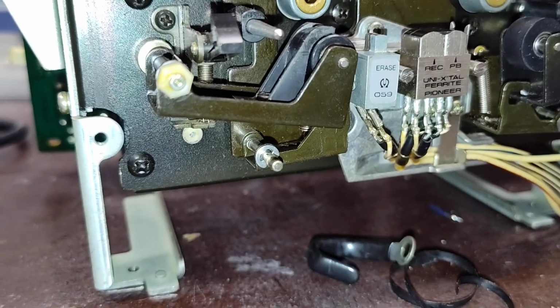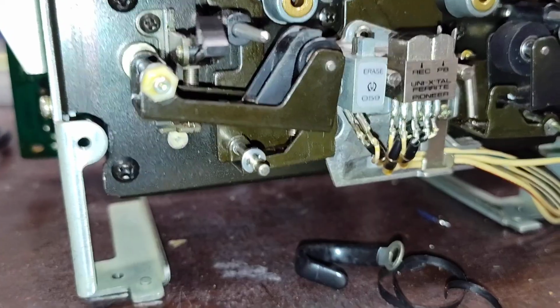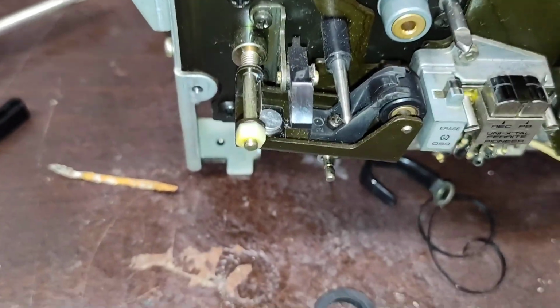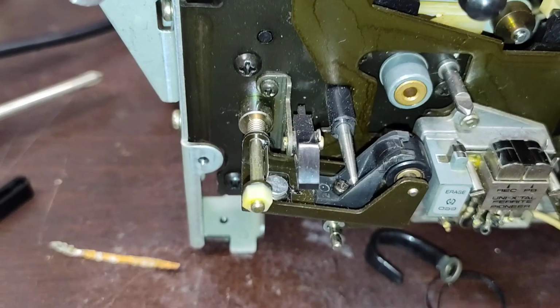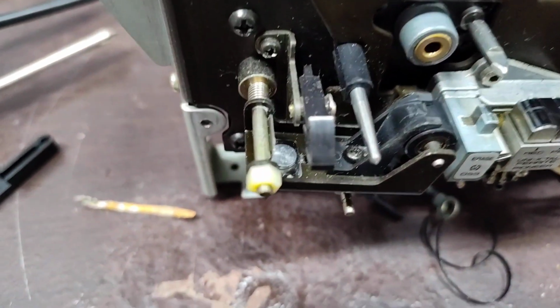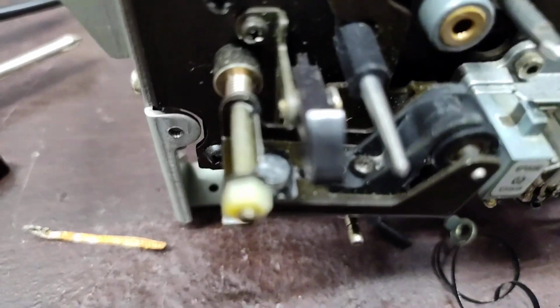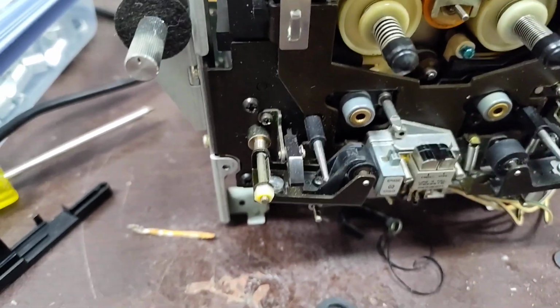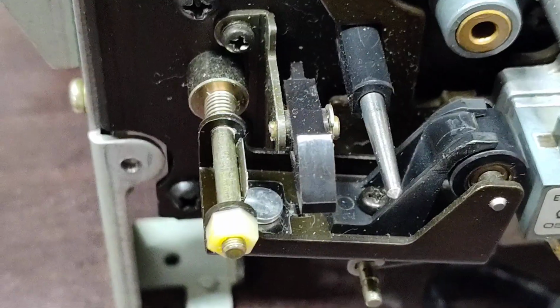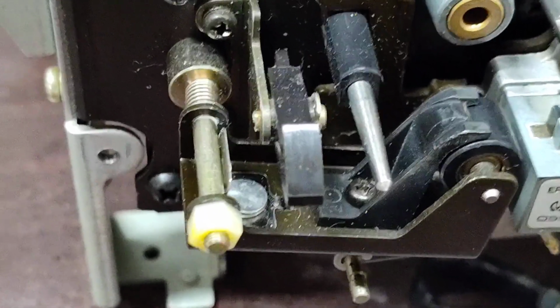Same thing, you want to pop the C-clip out from underneath the bottom one here. This one, you want to take a machinist rule and again measure. You'll want to measure between the top. It's hard to focus on this thing. So this one works better. Yeah, the top of that nylon washer and the top of the threaded post.